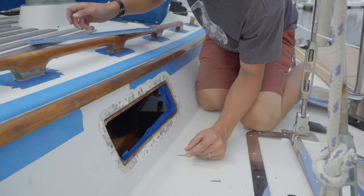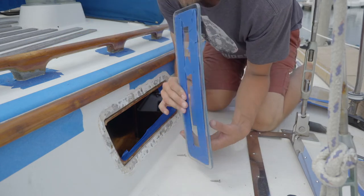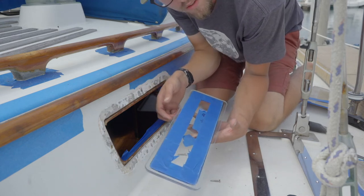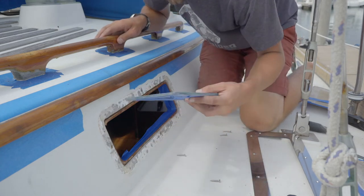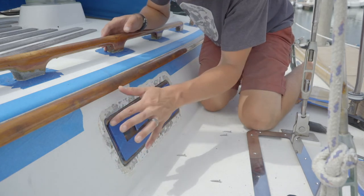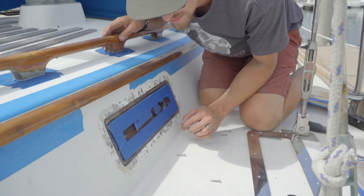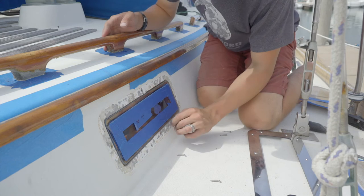For this non-opening port light, I have the glass here — you can see I taped around the edges. I had some 150 grit sandpaper and scratched up the edges to give it good tooth for the Sikaflex to hold on to. Not only is the tape there so I didn't scratch the rest of the glass, but I'll also be able to run my finger around, give it a good bead of Sikaflex, then peel off the tape, and hopefully be done. This port light is ready to go on.